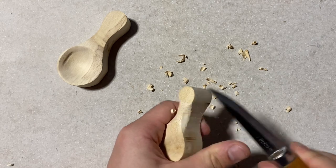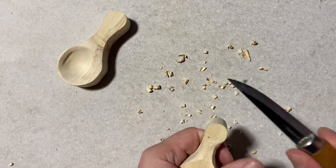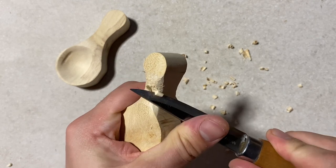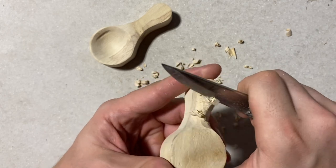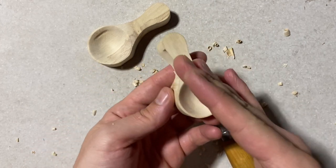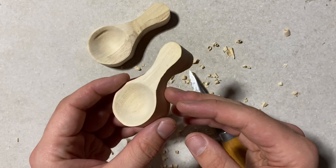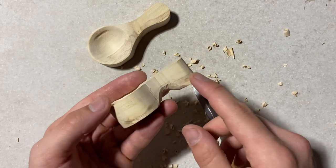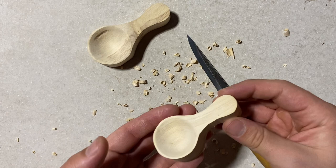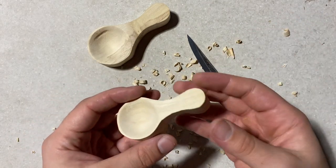We're carving away from ourselves here, but as we carve that dip deeper we'll be carving uphill, which creates feathering on the wood — don't worry, we'll correct it. Try to stop before you go upwards in the carving. I've reversed the carving direction so I continue carving down the hill. One thing some spoon carvers do is cut the initial shape on the bandsaw, which saves a lot of whittling time. Those trying to mass-produce scoops would cut the whole shape on the bandsaw and then just whittle the rough shape.